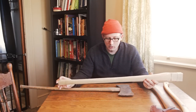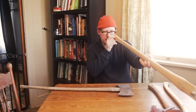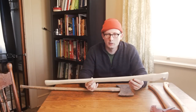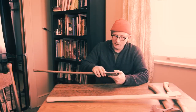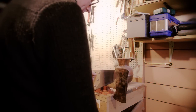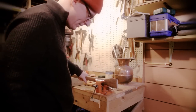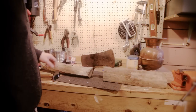The other thing I noticed is that not all handles were straight — this was the straightest one, just about perfect, but others deviated significantly through warping. So just be real careful when you choose a handle. The first step in re-handling this old axe is to cut the handle off and then hammer it out. I'm sawing it to make it easier to get the handle out of the axe head. I'm going to save this old axe handle for sentimental reasons and probably make something out of it at some point.